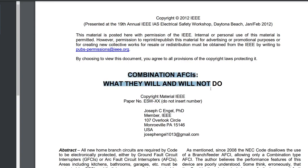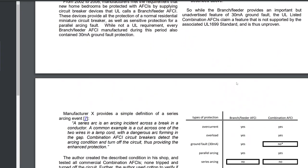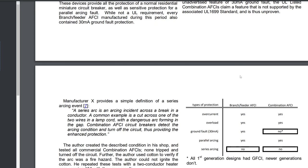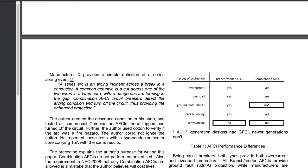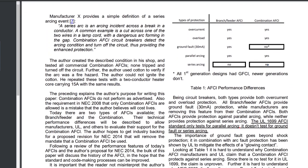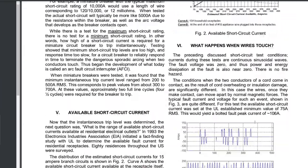The other thing is, there's this interesting paper I'll link below, on combination AFCIs. I'm not positive everything in here is accurate, or maybe things have changed, because it talks about not actually having series arcing. But you can see from my demonstration, I'm only doing series arcing here, and it is in fact completely tripping on my series arcing test. The interesting thing this paper does mention is this hot terminal problem, which is also mentioned in the standard.